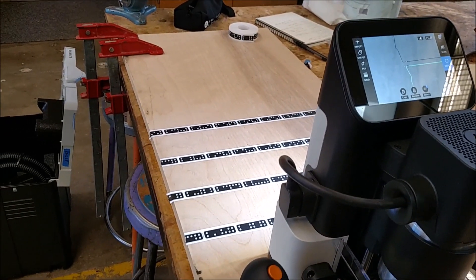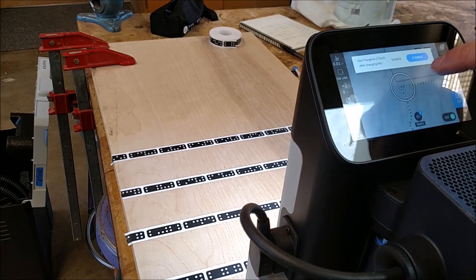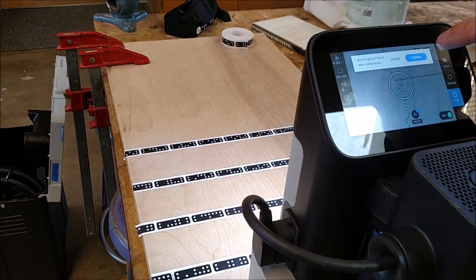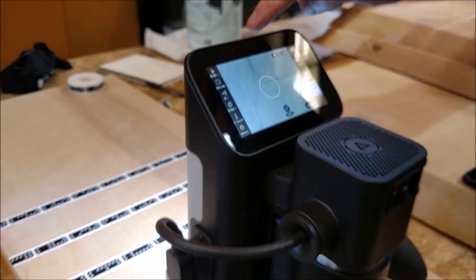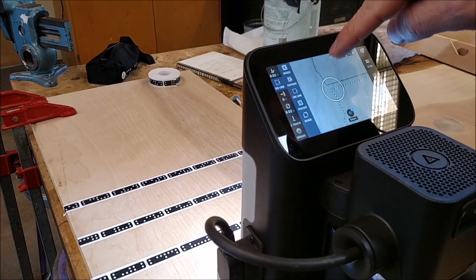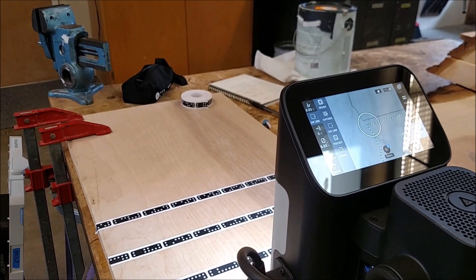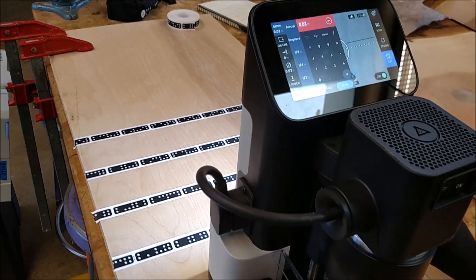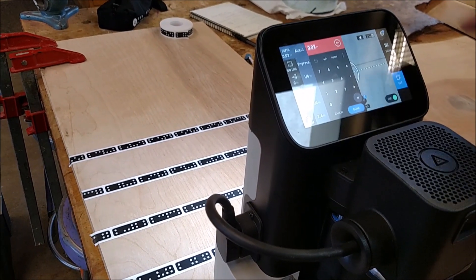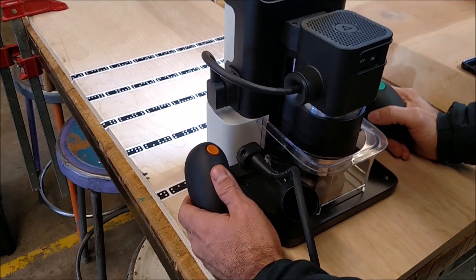You have to zero Z as well — we're about to do that right now on the cut dialog. Here is where you tell it what kind of cutter you have — we have an engraving bit. When you switch bits, it gives you a little dialog saying you should do a Z touch-off because you've got a new bit. The Z touch-off just comes down until the tip touches the surface, then it moves over. A really neat thing they added with the production version is the ability to change the cut type on the tool — this is super useful. One nice thing to do, especially when you're starting or if you have some fixturing problems, is to try an air cut. With an air cut, you don't even need to turn it on and you can fake-cut the pattern.